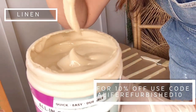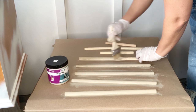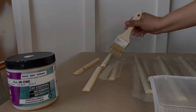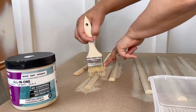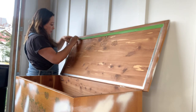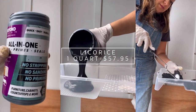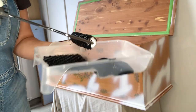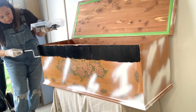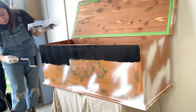First we're going to be painting the split wooden dowels using this linen color from Beyond Paint. I'm going to be completely honest, the consistency and the color are really making me crave some vanilla pudding at this moment. Beyond Paint is a water-based product so you can easily clean it with soap and water and there is no need to stir or shake — it's ready out of the can. The consistency of the paint is thick but you do not need to add any water to it. I'm going to tape off the metal frame to keep the cedar wood paint-free. To paint my chest, I'm going to be using a beautiful black color called Licorice. Try to roll out your piece as much as you can and use your brush for any area you can't reach with your roller. One of the few reasons why Beyond Paint is great for beginners is because it's lightly textured to eliminate brush marks, so it provides a finish that conceals imperfections. The paint flattens out but you're going to be left with a textured finish that's similar to a finish on a wall.